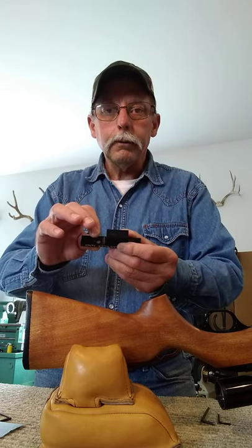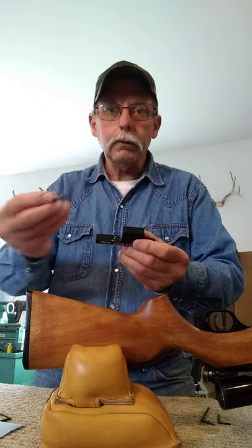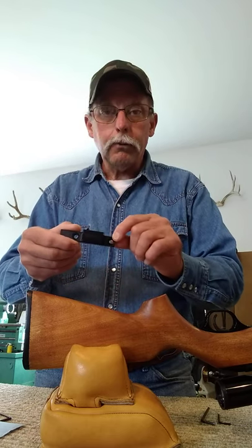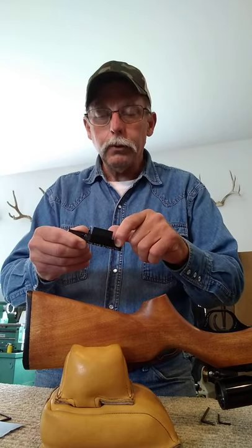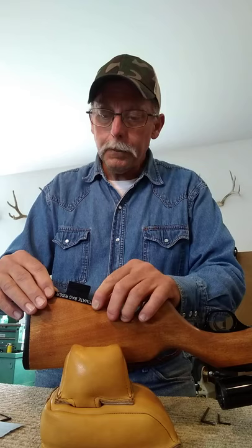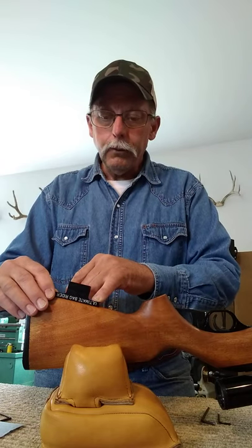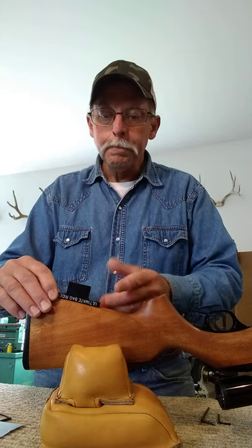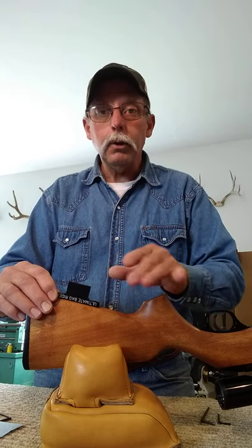One of the main reasons is this rear hole is counterbored to accept the square shoulder of the sling stud, and also countersunk if you want to use a flathead wood screw - that's an option also. The front hole is countersunk for another wood screw. If you want to add a second screw - on some rifles like my hunting rifles where I want to take the unit hunting - I want to add that second screw to make it more permanent and more solid, more insurance. Also on a couple of my long range rifles, I'm going to add the second screw to make it permanent since I'm planning on leaving the unit attached at all times.